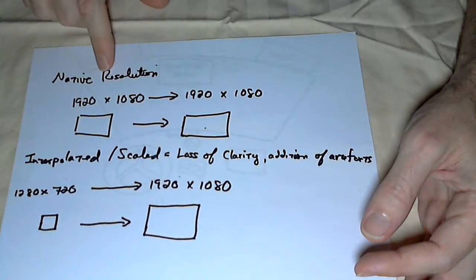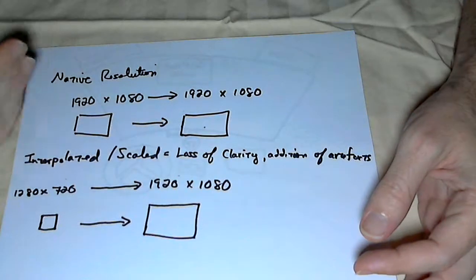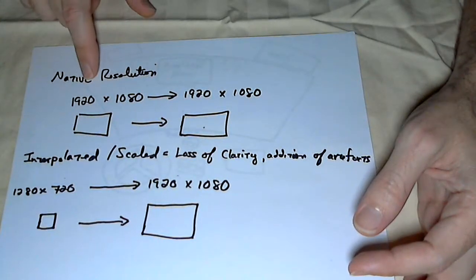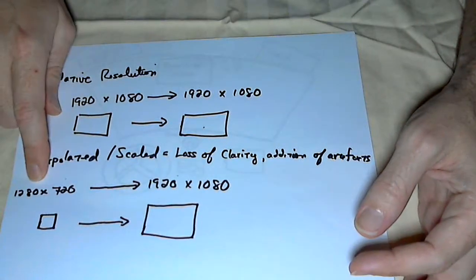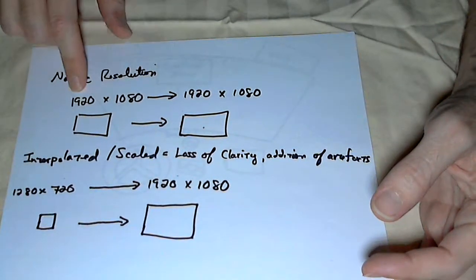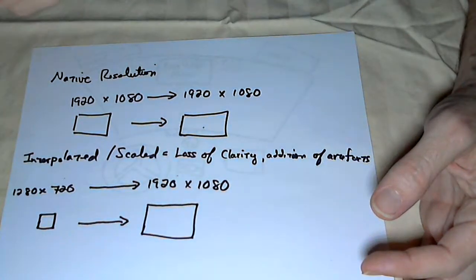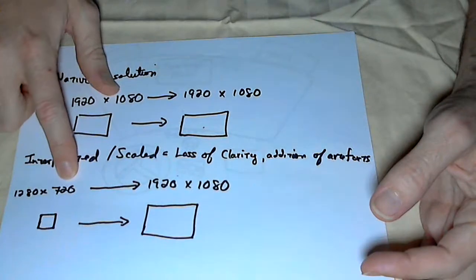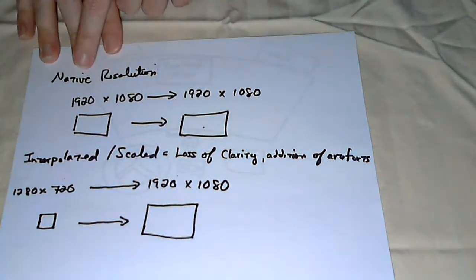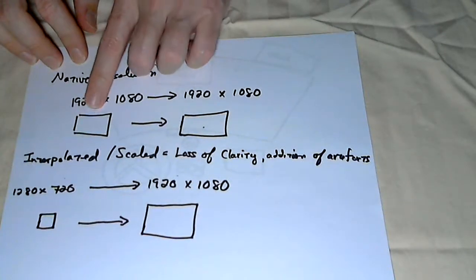So some of them will record, and you can. This is why it's really important to try to watch 720 versus 1080 sample videos. You may have a sensor that records 720 well, and it may say that it also records up to 1080p, 1920 by 1080, which is full HD. The problem is that it's not a more sensitive CCD. It's a cheaper CCD. It's just taking the little image and scaling it up. Whereas if we have more of a native resolution, it's able to record that.